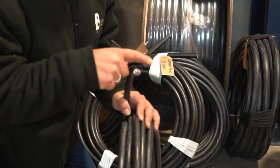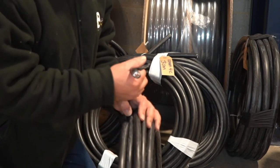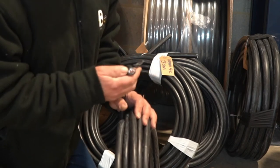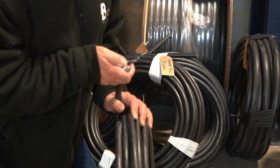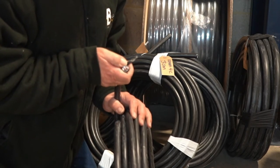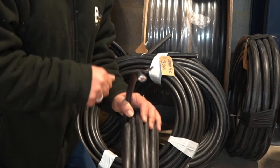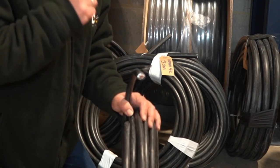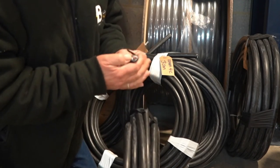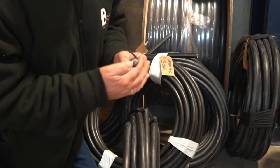Okay, the steel wire armour cable comes with its own protective plastic PVC sheath to withstand knocks and bumps. It also has on the inside, if we can zoom in a little bit, and we can see the steel wire armour cabling. That's the steel wire armour. That is to prevent maybe somebody having a good old go with a garden spade or an axe or even a chisel.